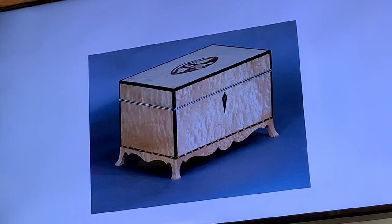This double 45 degree miter around the outside. The boxes are made out of solid wood and are spline mitered. All four corners are spline mitered. Using that quarter inch blade, that little 7 1/4 inch blade, set up everything, put a 16th inch spline in there because it fits 16th inch plywood, fits right in there. Put a clamp on it, you got a nice little box. Then you put all the veneer and inlay on it and you saw the top off.